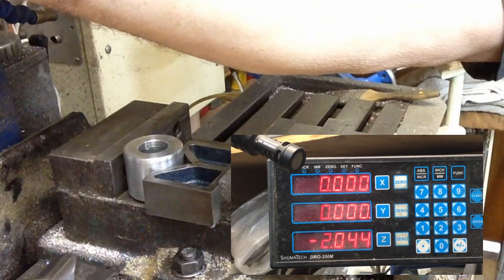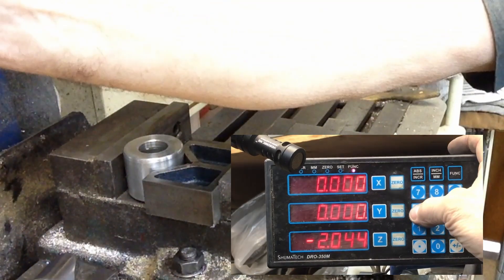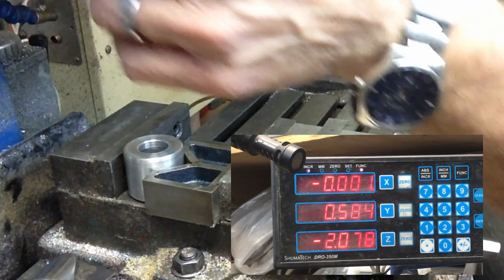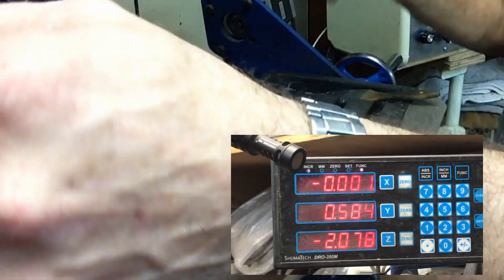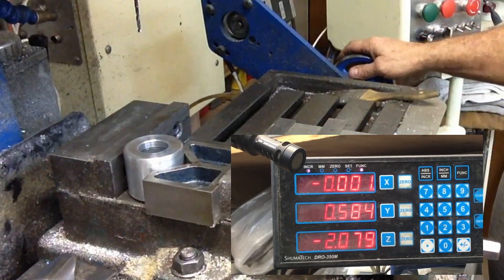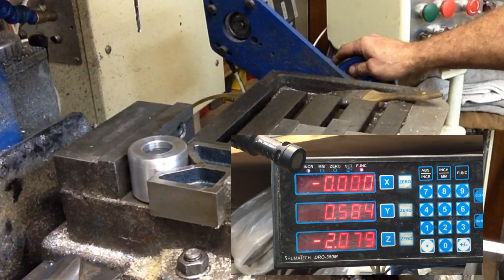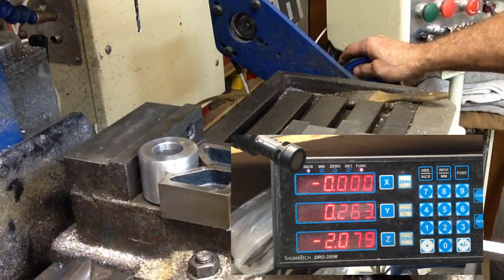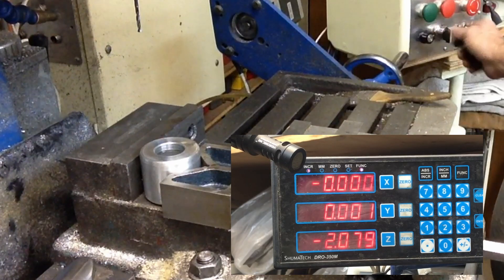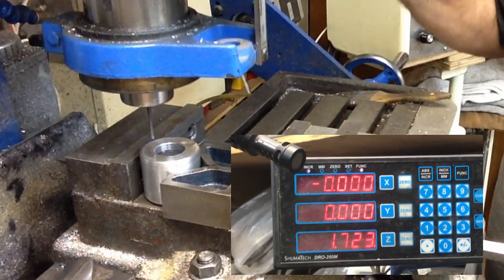Let's just do a dry run. The actual plotting of that is function four. Hole one. Enter. Now we're in incremental mode, so our X and Y are the only axes we're interested in. The Z is just where it's at. For all intents and purposes that should be a zero on top — we're just moving the top. We'll go ahead and set it to zero and go back to zero. If we plotted that right, there's our first bolt right there.